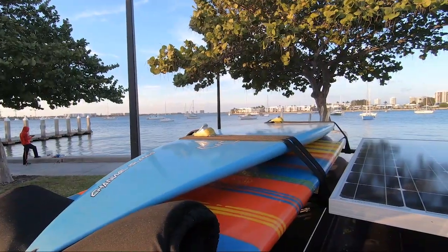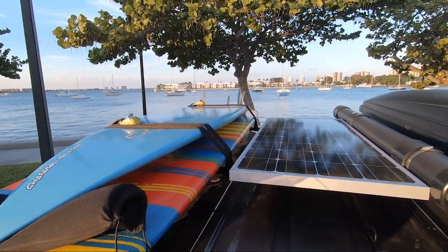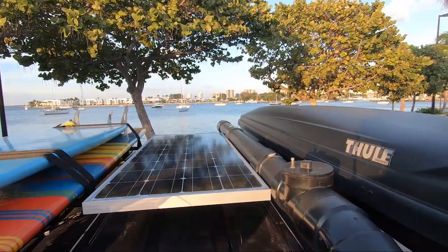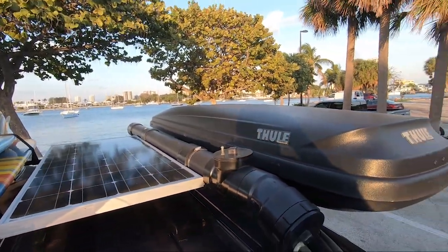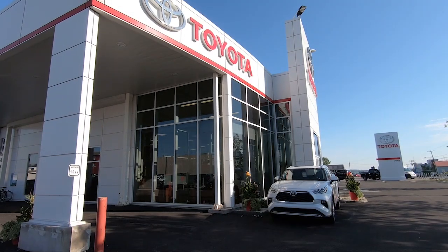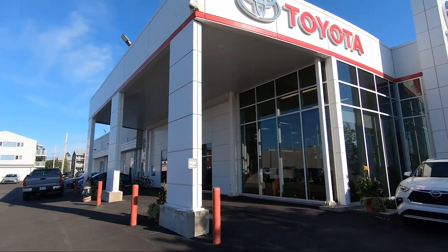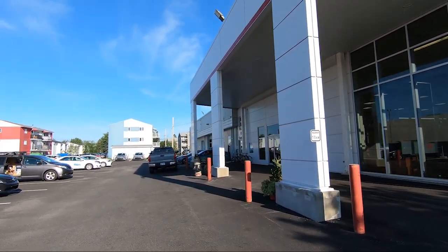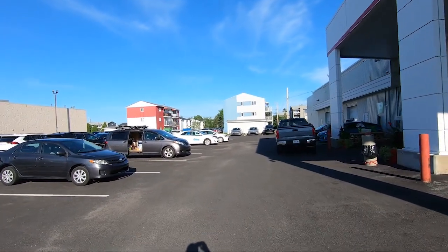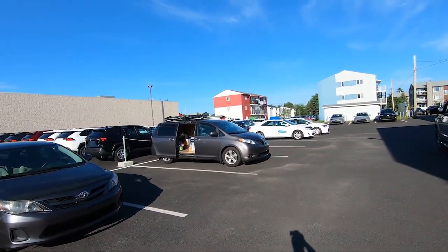First thing to mention is that the electric setup for my van conversion is completely separate from my vehicle electric system. This means that I do not charge my auxiliary battery with the vehicle system. There's a huge advantage for this if your vehicle is still under warranty. If you modify your vehicle's electric setup, they may void part of your warranty. You may want to verify this if you are thinking of going in that direction.